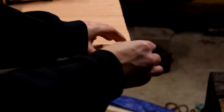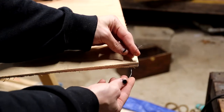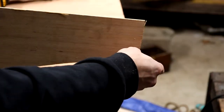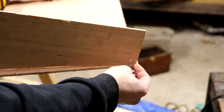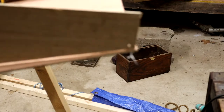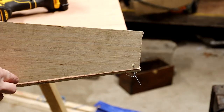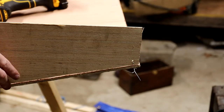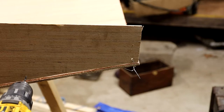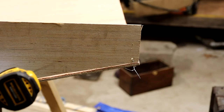Here I've drilled two small holes for my mechanics wire to go through, which is the first stitch of this hull. This is to keep the chine on the bottom, so I'm just going to work down this side of the boat to do some more stitching. There's no specific way that I do this — I just eyeball it and drill, then stitch. There's no limit to how many you can do, and you definitely can't do too many, but you can do too few. So just be generous with your stitching and you'll be fine.